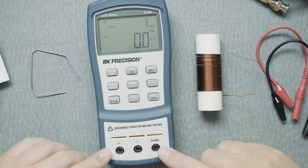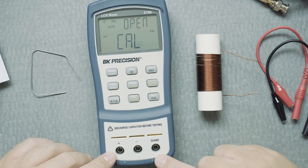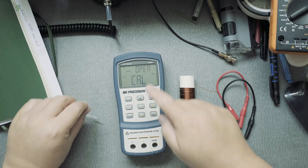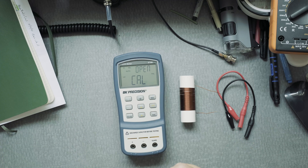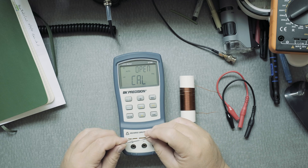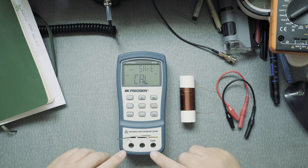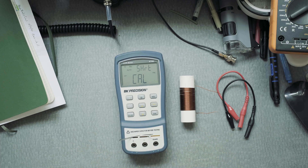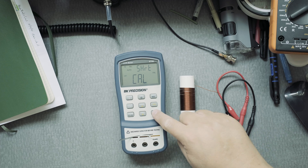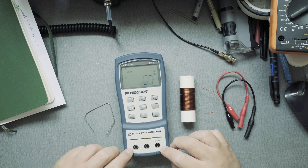For a closed circuit, press and hold again on the relative mode button. Wait until the REL is blinking and the open circuit is stated. Then use a paperclip and put it in these slits here to close the circuit, making sure everything is clear. The paperclip gives you a short between the two contacts, then press the relative button and now you are calibrated and ready to go.